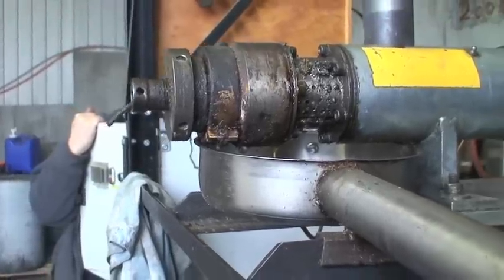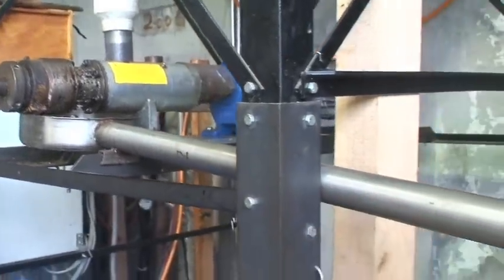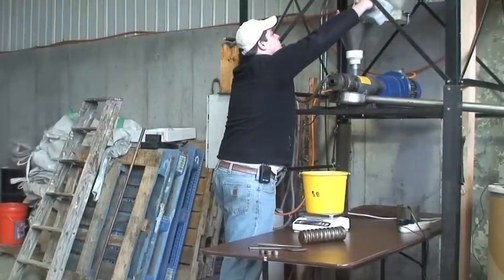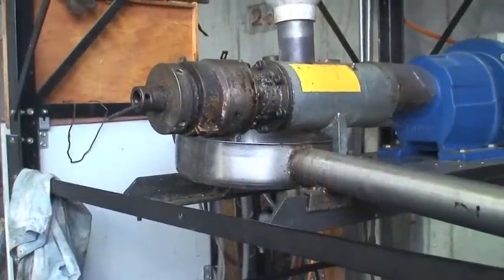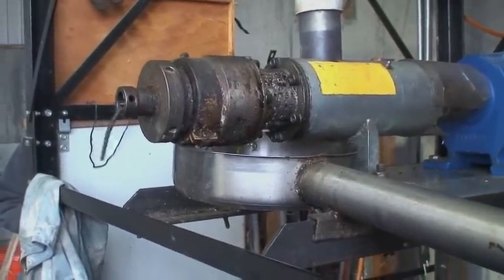The presses evaluated are all considered small-scale cold presses appropriate for on-farm use. An oilseed press essentially extracts oil from oilseeds such as sunflower, canola, and soybeans. The seed starts in a hopper or feed bin, is forced through the press with a rotating screw that also crushes the seed against a nozzle and screen, separating the oil from the meal.